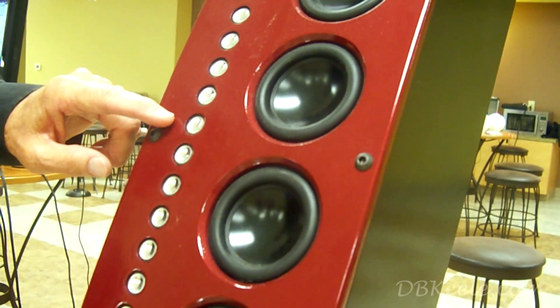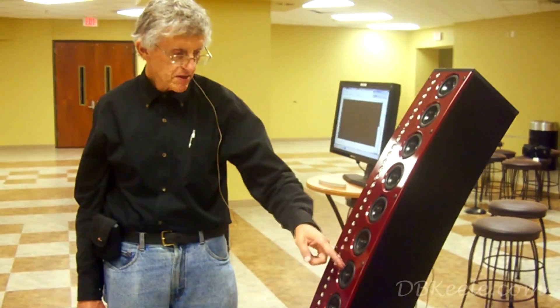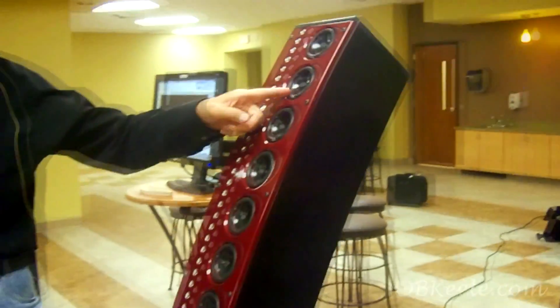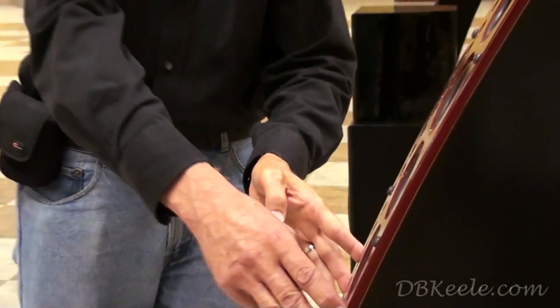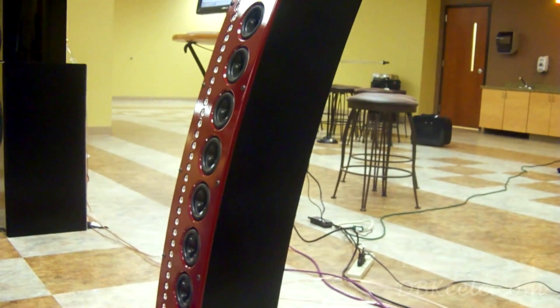It's actually a wide-band miniature speaker used in some applications from roughly 500 hertz on up. In this particular instance, we have it crossed over at one kilohertz to the 18 mid-bass frequency drivers — which is also quite low for a system of this type. And of course you can see that it's rather narrow, which makes the horizontal dispersion quite broad.